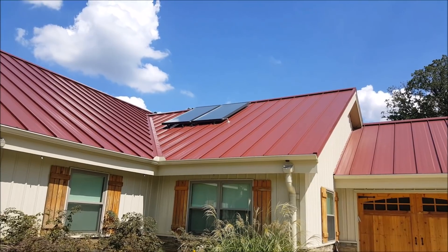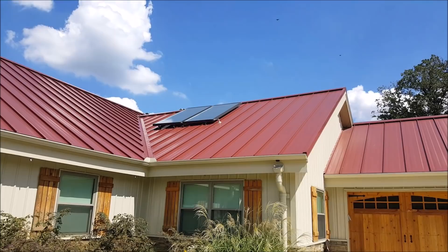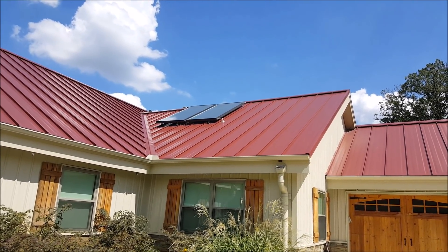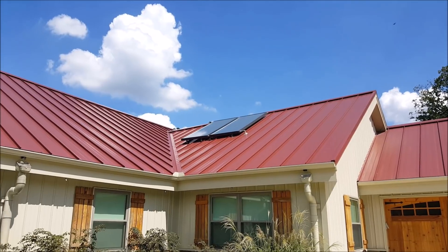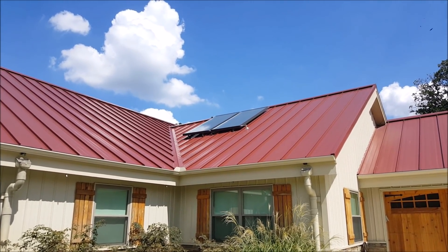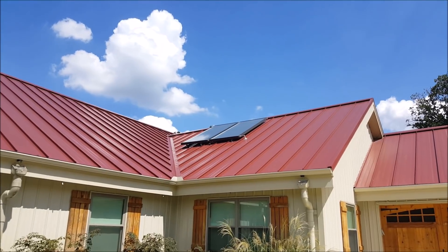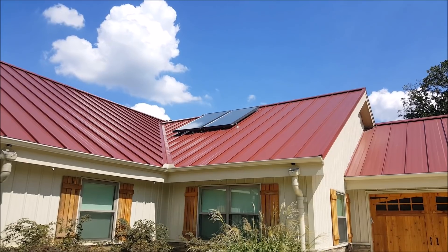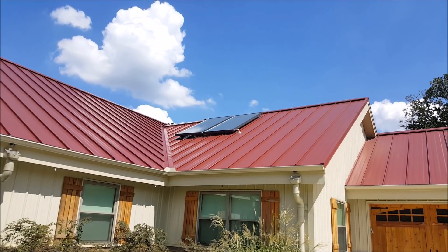Since I'm kind of right on the edge and we don't have a lot of super cold days in the winter, I went ahead and got this direct system. What I did this last winter was when the first sign of freezing weather came, I just drained the lines and shut it down, and we just used our standard backup tankless water heaters all winter long. Then as soon as we got past any chance of freezing weather this spring, I just turned them back on. They provide all the hot water we need during about eight months of the year.